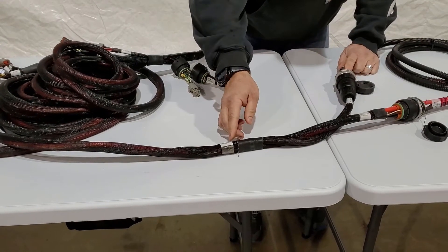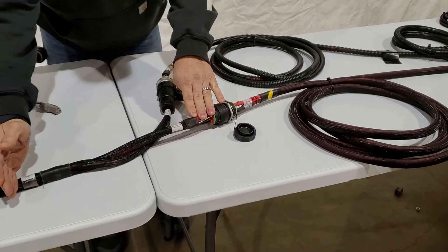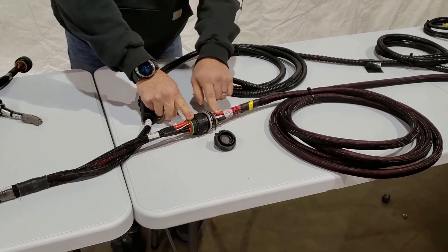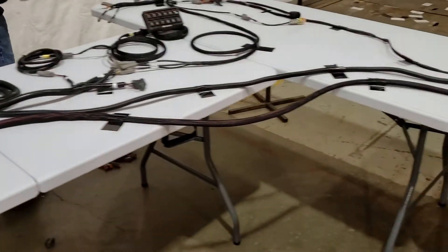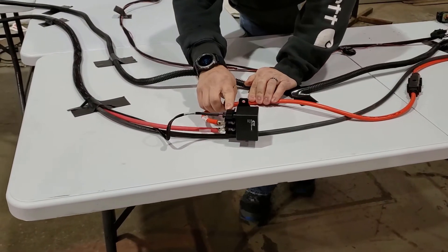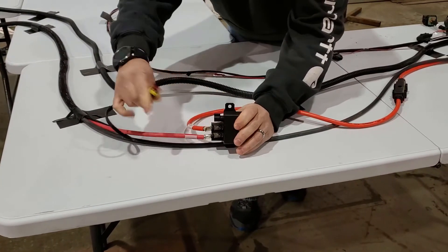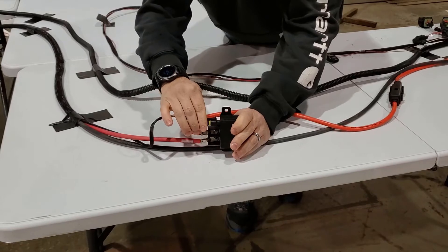At this Y, they turn around and come back up into the high current harness — they don't continue any further than here. These two small wires are trigger wires. We're going to follow those through the plug into our high current tractor harness, all the way back to the relay located by the battery. Those two small wires are going into this plug on the 130 amp relay and tell this relay to turn on. If you unplug it, you might be able to hear it click — that's how you know if you've got switched power coming through the system.